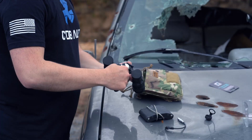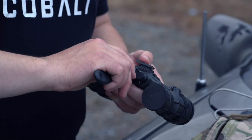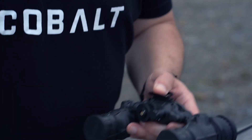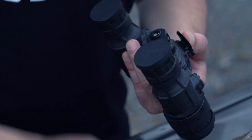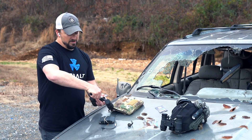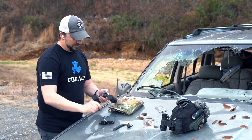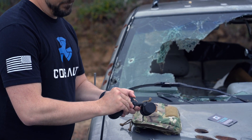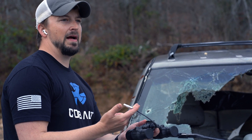What I'm going to do is set my wrench, get it about right, and turn my system while holding the cap clockwise — just like this. If you have to force it, you're not doing something right; it should just kind of slide on by. Now I'm around to about what I consider the two o'clock position. Let's test fit it again just to make sure. My Fisher connector dots line up — there we go. Now that's going to be offset to the right side and ready to mount up to my battery pack.